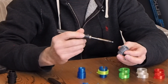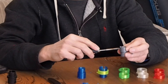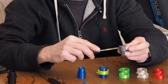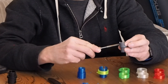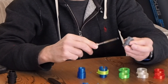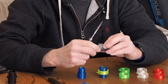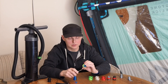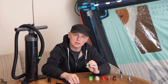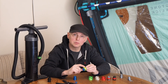What I've done is I've tried to improve the model there, but there's not a whole lot I can do because layer strength is a problem with 3D printers. What you can do is take a soldering iron, heat it up to about 200°C or a little bit under, and just swirl it lightly around the end of the slot so that you bind the layers together in that spot. Hopefully this latest version is going to last a little bit better.